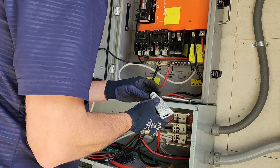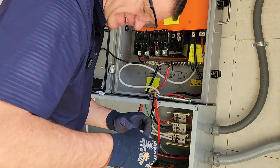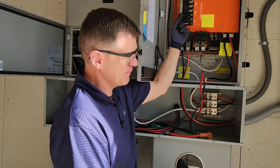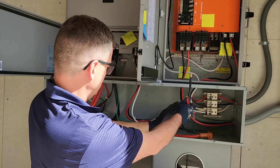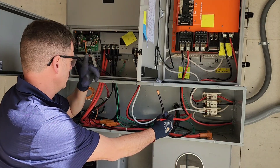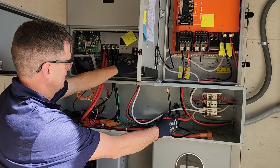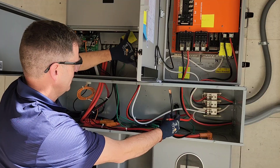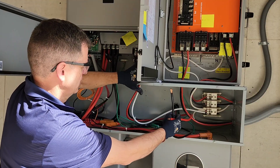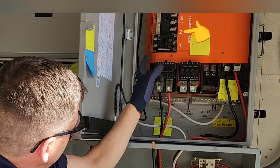This wire is not going to be there very long to corrode because I'll probably be pulling this out and doing something else. So now I just need to hook up the hybrid inverter. I've got these wires going to the inverter, but these are the wires that were on the load port, so I need to first move them over to the grid port. This hybrid inverter can back-push and pull energy from its grid port. So I'm just going to switch these wires over and then connect them into the breaker.